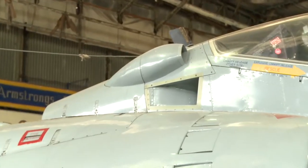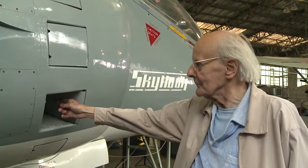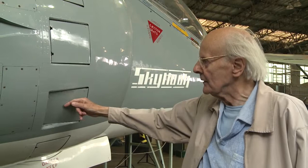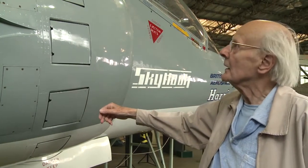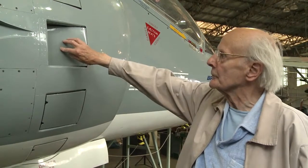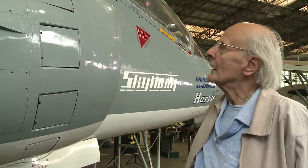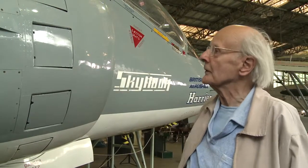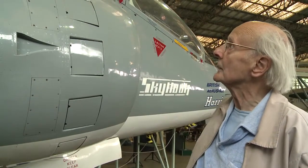To complete — or rather, the solution to the intake problem — we have a series of blow-in doors, so-called. They're entirely free to operate as the air pressures decide, and when the engine is running statically, all these doors will be fully open. There's a continuous slot on the inside which feeds into the engine face, and that helps to keep the static efficiency of the intake up.